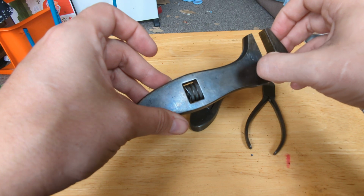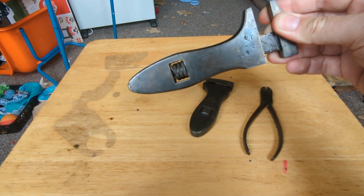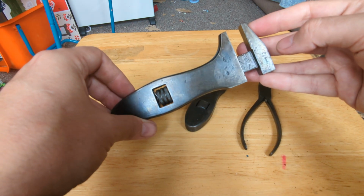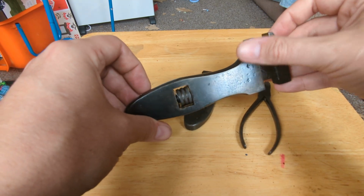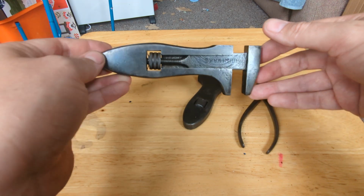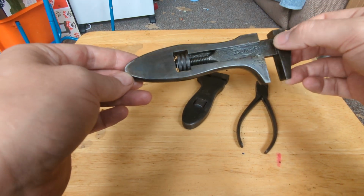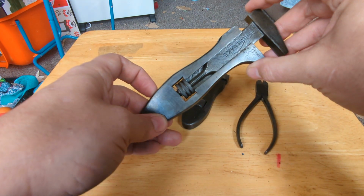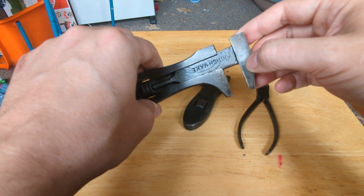Since then, I have taken this down to sort of an average level of polish and used some, what is it, Birchwood Perma Blue on this, using their bluing kit, and oiled it, and it's come up pretty nice. I'm only after a functional finish on this. The main idea behind my channel is sort of to go for tools that I'm going to use, unless I'm sort of given stuff or get some particular bargains in like boot fair sales and so on. But yeah, so I'm going for tools that my toolbox really needs, and these are far more solid and capable than the equivalent wrench that I could get for the same sort of price, which I believe this cost me £4. There is no way you would get that much high quality steel in a £4 cheapo wrench that's going to be half plastic, and the metal will be so low quality it'll snap the first time you use it.